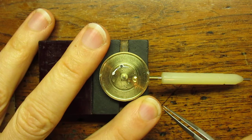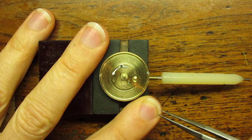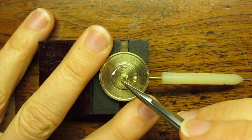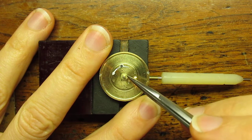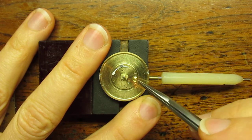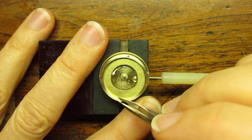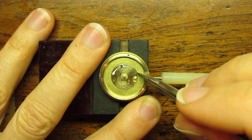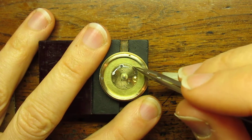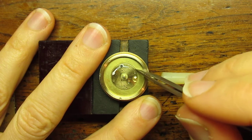I don't know how well any of this is going to show up until I watch the video myself, but this 20-tooth gear, like the minute hand, will rotate around once an hour, thereby driving everything else. To this arrangement we add the internal gear that I cut — the one I spent so long figuring out how to do — and it rides in the channel that I've cut on the base plate and rotates around.